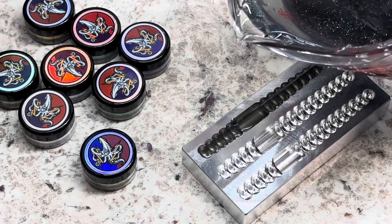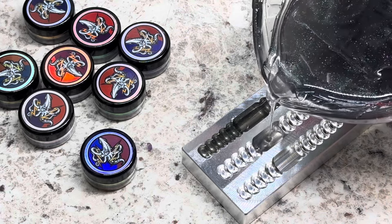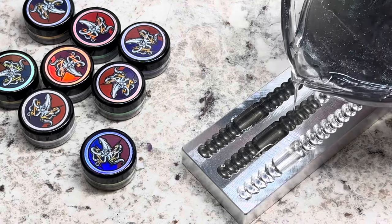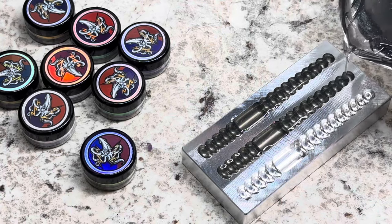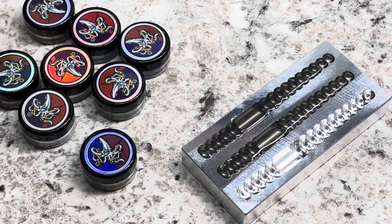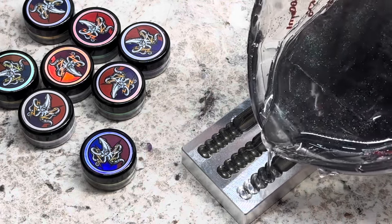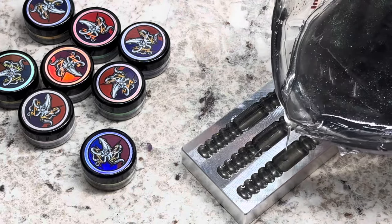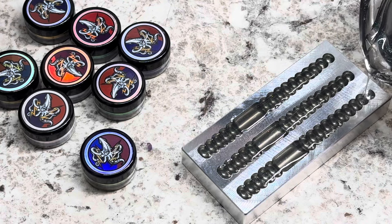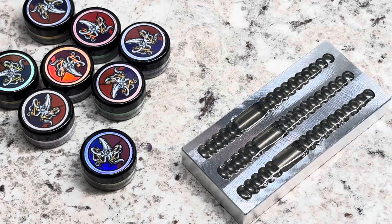Try to stay in the lines. This requires a lot of concentration — it's very hard to do too much when you're doing this. Now we're going to work our way back down, top it off, and let it quit dripping. Sometimes I have to wipe the tip of my cup off so it's not causing any problems. We'll move on and do the third one. Make sure we get that full. If it's cold outside, I'd also recommend heating your mold up — I heated this up with a heat gun just to make sure I didn't get any cold cracking or issues with it not running right.